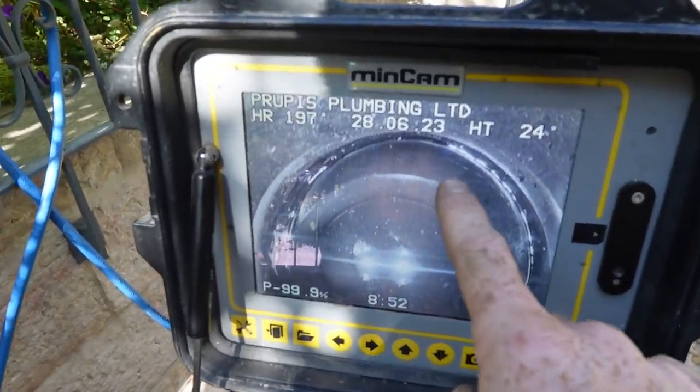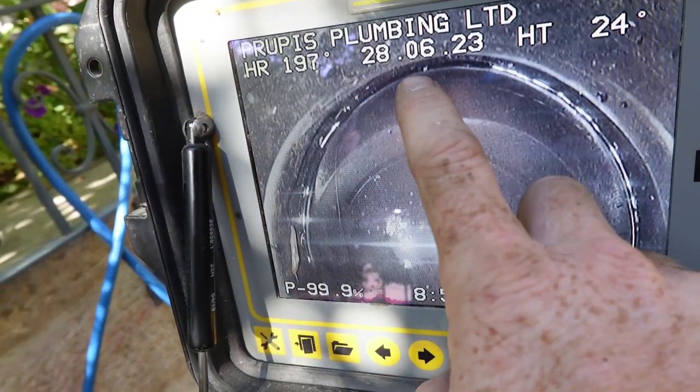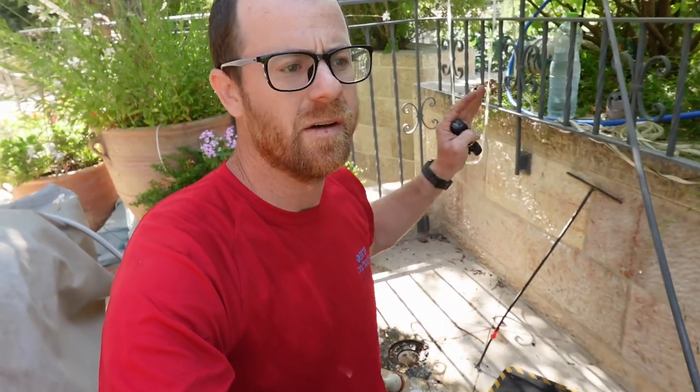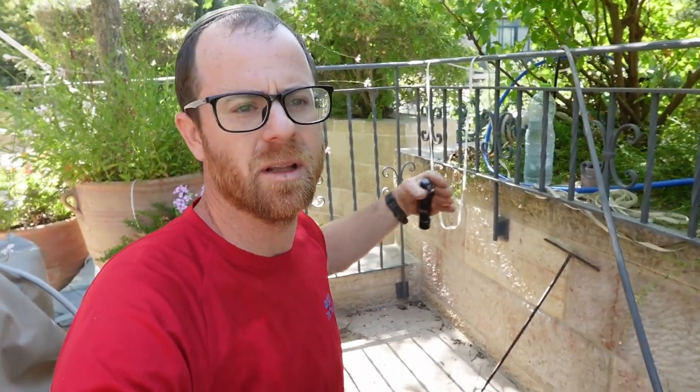They originally thought it feeds a garden but not sure. We're doing a hydrostatic pressure test - the water level was up to the 6-inch mark and it's dropping. We put a balloon in here with a compressor to cover up the T, and filled the line from the drain to the T with water. There are a lot of connections there so this test will just give us a baseline - is the problem in the horizontal line or not? As it appears now, the water is dropping. We're gonna look downstairs in the apartment to see if water is dripping, and it seems like there's water coming out from the stonework steps and entrance too - might be the same leak or a different one. We got drippage in the apartment!